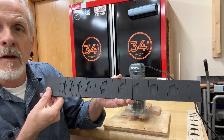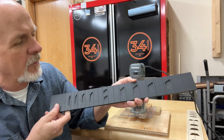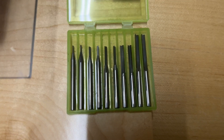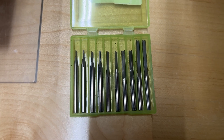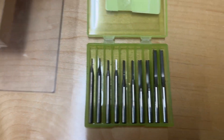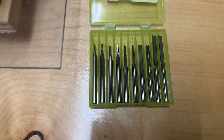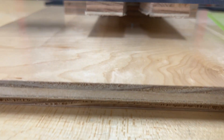That's basically how they come out — just fill with your choice of epoxy resin. I think I'm going to try to create kind of a white pearl to go with the black and we'll see how that turns out. This is the little set of router bits I got off Amazon — they're 1/8-inch shank and go from left to right: one millimeter, 1.5 millimeter, two millimeter, 2.5 millimeter, and about 3.17 millimeters which is the full 1/8 inch. For this application I'm using the 1.5 millimeter, and the pin is exactly 1.5 millimeter as well, so they match up perfectly.